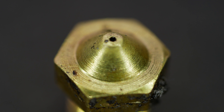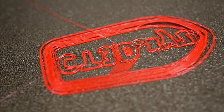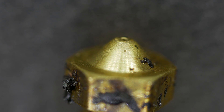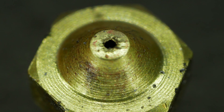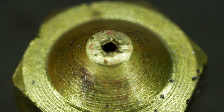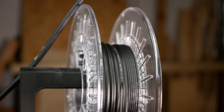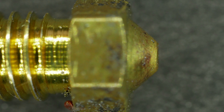What I was able to spot was that the tip was horribly wearing. This wasn't only visible on the macro shots — I also noticed that the first layer thickness increased over time as the nozzle became shorter and shorter. The abrasive carbon fibers rounded off all of the edges, which is a very clear sign that something is wrong. The wear pattern on the nozzle reflects the fact that the printhead only moves in X and Y and at plus and minus 45 degrees. After 360g of material my leftover filament was gone, and the same goes for the nozzle.